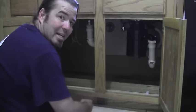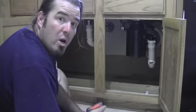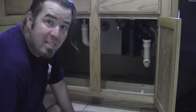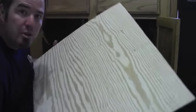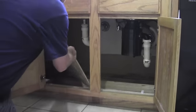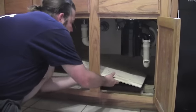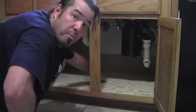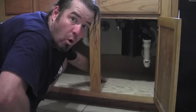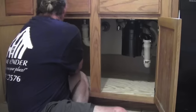I want the break to fall right behind here, so we're just going to measure over and cut ours at about 21. Place the boards in the cabinet and fit the seams together. If you cut it upside down, you can have a nice finished cut without splintering. After you get the floor in there, let's nail it down. Remember to mark where your studs were so you're not poking holes in your new floor. Secure with finishing nails. And done.